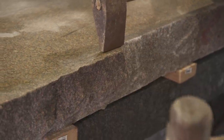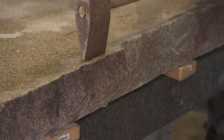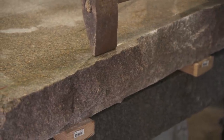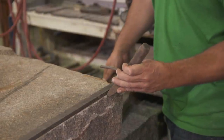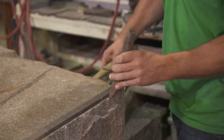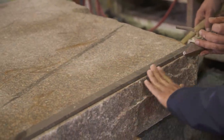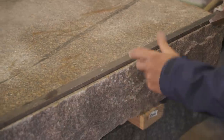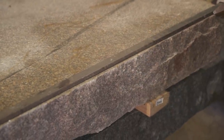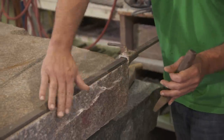That's satisfying. Slide it this way so we can get more of the bite. Now we're going back to the line — this is the top of the step. We're going to finish it right back to the line with the chipper. This will be the tread surface when you walk up, so this needs to be cleaned so no one's shoe catches on it. We're going to hit it with the chipper, then take a little pumice wheel and just take off the sharp edge by hand.